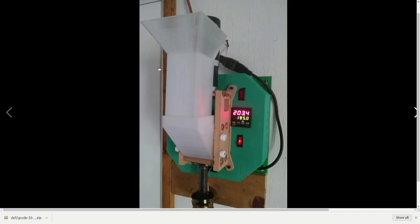And here, the heat does all the work in principle. Upon startup, you're going to have a bunch of molten mass in there, so that's where you would need some more help. But in principle, the motor power requirements are not too huge because you've got molten plastic, which is relatively easy to move around. It flows. In fact, if you're flowing plastic, this thing would dribble plastic out the bottom. So the force requirements on the auger aren't too big.